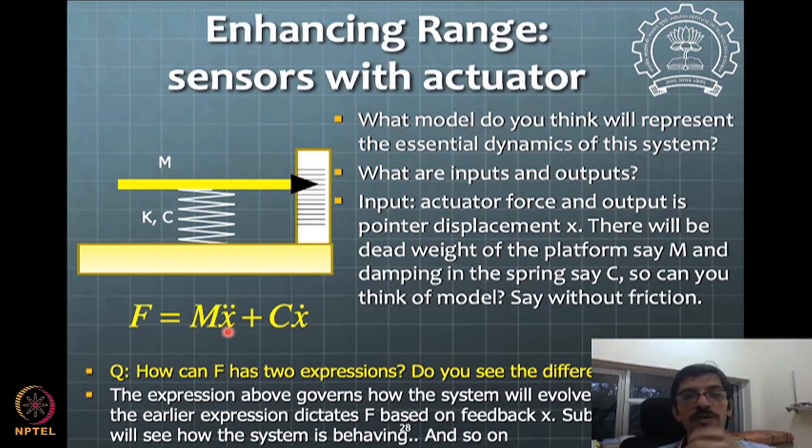We have seen that for linear motion we'll put some kind of rack and pinion or this screw kind of actuator. If you start putting that, it will certainly balance, through null balance. But now the system is locked in this place; any place you take, the system will be locked. So even if it is at zero and I place some more weight on the system, since it is not back drivable, I'm not going to get any deformation here. So the screw kind of actuators will not work unless they have very smooth back drivability, and typically screw actuators will not have back drivability.